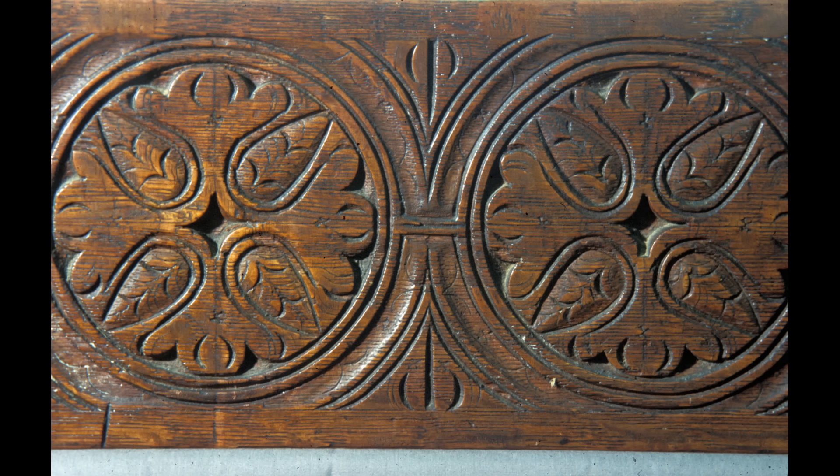The drawer front, at just a glance, is really just a doubled-up version of the top rail's lunettes — same diagonal tulip shapes, same concave outline broken north and south. The layout is distinctive to the drawer front: there are seven of these rosettes and then some alternating pinwheel motifs between them. It's the same elements, same treatment on a much different scale. This is six inches high for the doubled-up lunette, compared to a four-inch high half circle.